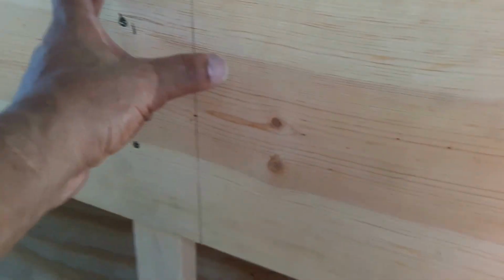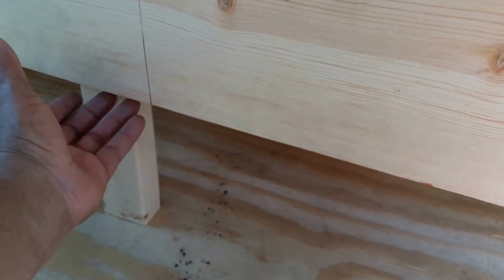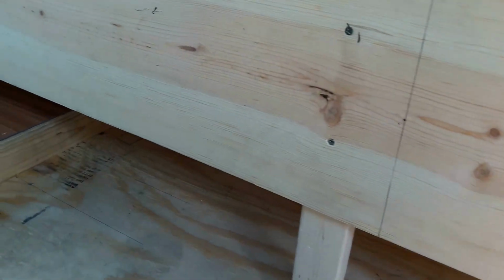Back to what I said about this panel, it'll be split in two from the side, and I'll have a support beam that'll go all the way across through. That's why I built it this way. I wanted these legs nice and strong. That's 2x3, so I can just rest those boards right down on that beam, and then I have two swivel locks to hold that panel in. You can get in the hole underneath the bed at any time. It's 30 inches, lots of storage there.